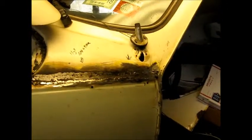So I got to work on the transition up at the top, and see, it gets covered by this piece of molding here. So not an issue. And you don't even see what I'm doing, but we still want to make it good. So I got the dog leg in, and like I said, I flanged it and then slid it underneath and then tied it into the top of the Fender and then over to here. So there's no burn throughs, but it's this transition here I got to work on next.